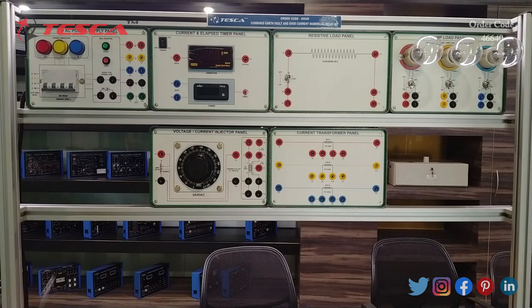Moving towards the first panel, this is our 3-phase AC power supply panel in which we have 3 power indicators connected with a 4-pole MCB introducing R, Y, B and neutral phases for the 3-phase power supply. Then we have a dual starter section with start and stop buttons provided. For normal use you can short this terminal for operating the dual starter. There is also a NO terminal of the contactor connected, and the 3 output supplies of R, Y, B and ground are provided on this first panel.